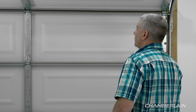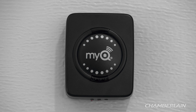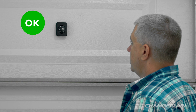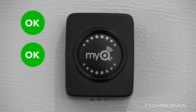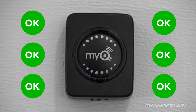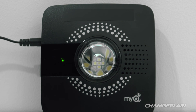To test the battery, start with the garage door closed. The door sensor should be mounted on the top panel on the inside of your garage door. Press the test button — the LED on the sensor will blink. Wait 10 seconds, then perform the test again. Do this 5 more times, waiting 10 seconds between each test — that's 6 times total.